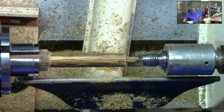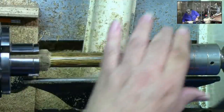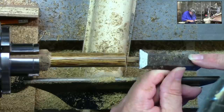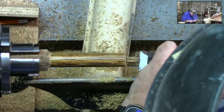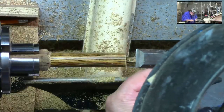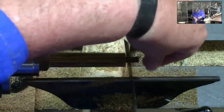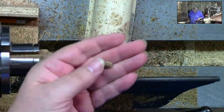Now that we've got that done, we'll take our little saw here and we will cut that off. But let's do one thing before we cut that off — it's one of those things that seems like I forget every time and then I have to use a grinder. We're going to come in with a chisel and just put a flat on this, not quite but about a quarter of the way through it. That's looking pretty good. With it still on the lathe it's so much easier to do, because on a small piece like that, trying to hold it on a sander even with a pair of pliers can be a little bit rough.